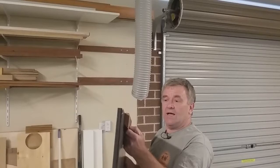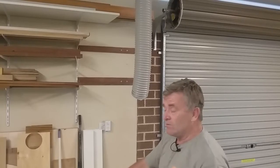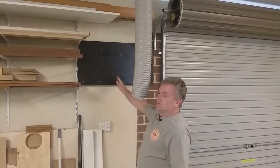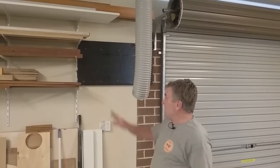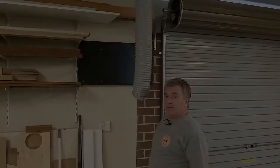The way I hold the motor up is just a French cleat on the back of this board. The reason being - I mount the motor on here and I'm able to lift this up on my own, one-man operation - don't need two or three mates to come and help put something up. Once I've got the motor on there, I'll just put it back up on the French cleat. It'll stay there until I get all the screws into the rails. I'll get it sitting up on the workbench, drill the holes, bolt it all together, and drop it back up on the French cleat.